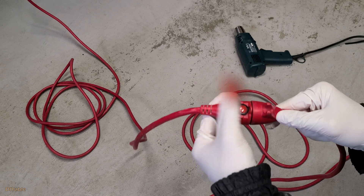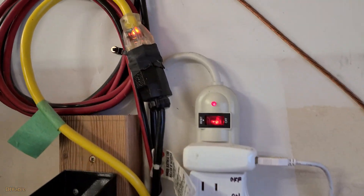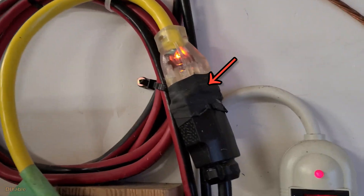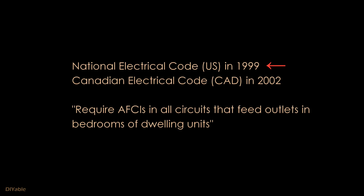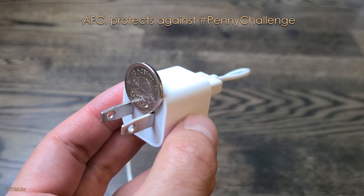Here is another DIY tip of the day. When you buy a new extension cord, look for one that comes with a lock — it cannot move unless you unlock it. For any other extension cords that don't have a lock, use electrical tape to secure the connection point. One simple but expensive solution is to upgrade the 15-amp breaker to an AFCI breaker in the main panel for the garage receptacles. If your house was built after 1999 in the States or 2002 in Canada, you already have AFCI in all your bedrooms — meaning the TikTok penny challenge would not be successful if kids did it in the bedroom.